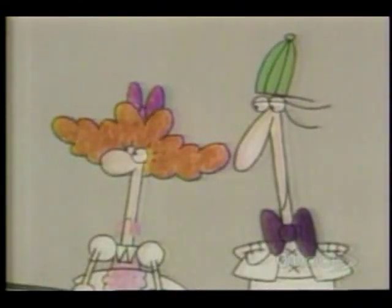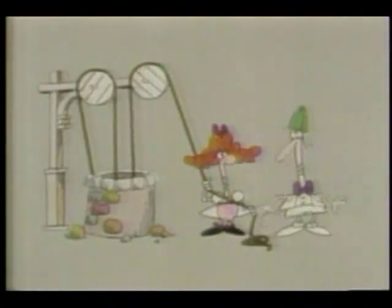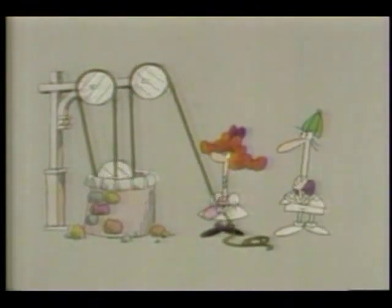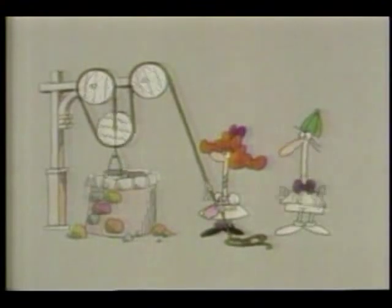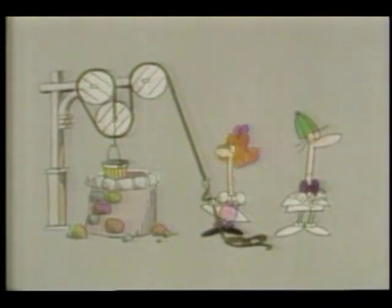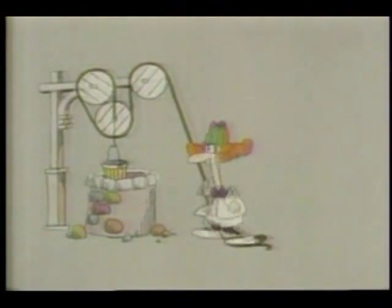The way Jill used the pulley is still twice as effective as the way Jack used it. There are lots of other ways of combining pulleys. With the pulley system that Jill finally rigged up for herself, she had to pull the rope three meters for every meter that she raised the pail of water. In a sense, she'd become three times as strong as Jack.